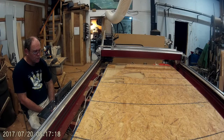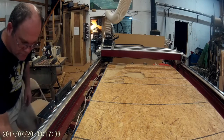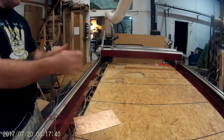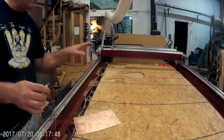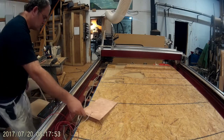The first thing you have to do is zero the head. I found out that the carbide bit conducts electricity, so what I do is I took this metal plate underneath the bit and I put this clip on the bit and I slowly lower the bit down onto it until it makes contact, and then I have an exact XYZ of the top of the piece I'm working on. So let's go ahead and do that.